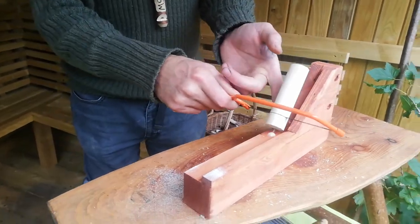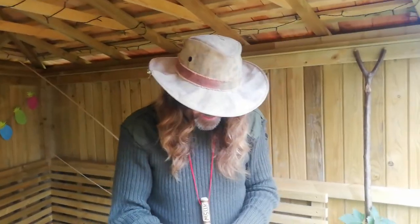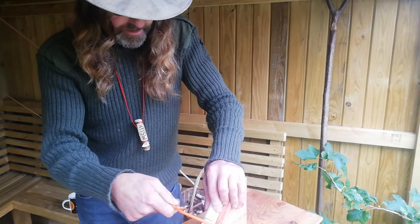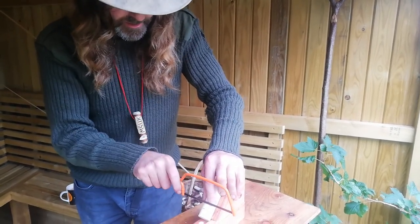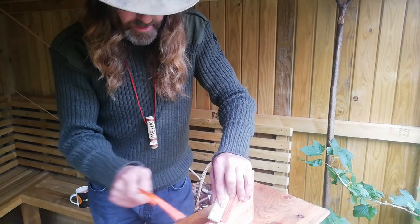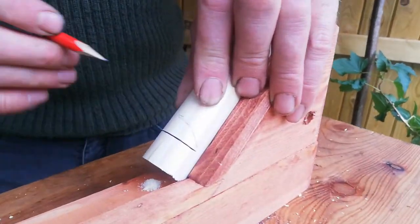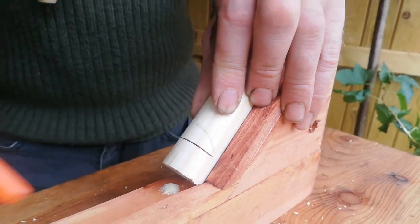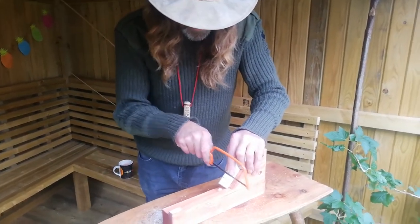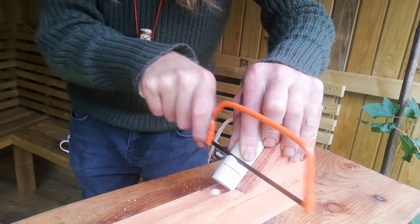Keeping that in place, I position it on the jig all the way to the bottom. I'm looking at the very bottom of this saw cut where the teeth of the blade are, keeping that in my mind. I lift the blade out and now I want to go straight down vertically with a cut that's going to meet the bottom of the cut I've just made. So it's going to come from here, vertically down to there, like that on both sides. This is a 45-degree cut.